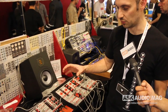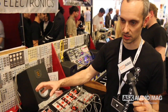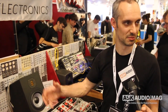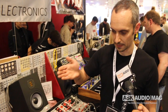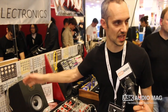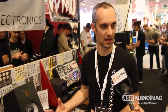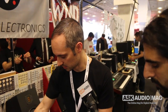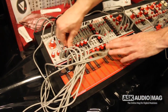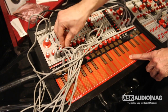The flagship module of our line is the harmonic oscillator, which is an all-analog design done in the style of 70s electronics — a discrete transistor-based triangle core oscillator that multiplies the root frequency by 2, 3, 4, 5, all the way up to 8. It gives those harmonics on separate outputs, with a voltage-controlled mixer to blend them together using these sliders and controls.